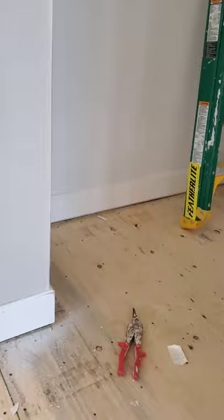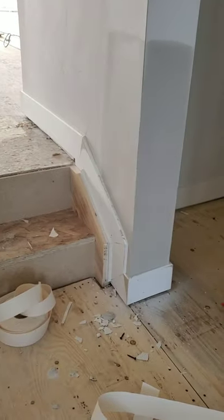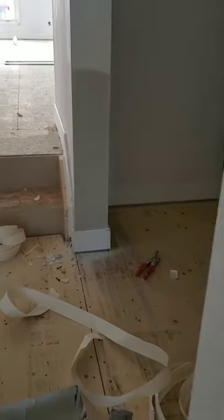Okay, and you can see you can almost sand it like that, but you got imperfections like these little bubbles here at the bottom. I'm not going to wipe all my mud away, so those little bubbles will be filled on the last coat. Sorry, I should say this is the second coat. We're going to do a last third coat, and no problems, everything A1.